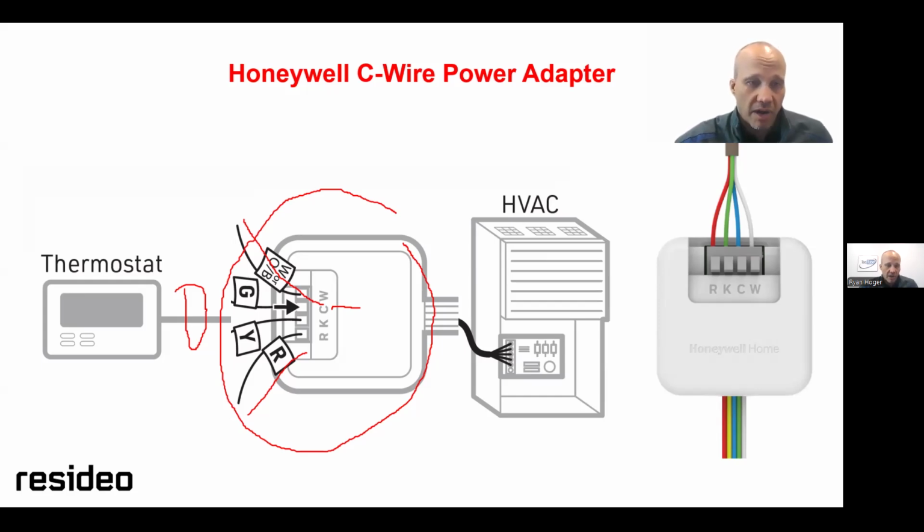And then the other wire that you had gets put on the K terminal, which is very similar to an ecobee PEK terminal, and that K terminal's job is to combine the fan and cooling into one signal. And when you bring it downstairs to the furnace, it goes to K. So yellow goes to K, green goes to common. So it works fundamentally the same way that the ecobee one does. They speak a little bit different language, so you can't swap them around and use one and the other one, but fundamentally they work the same.